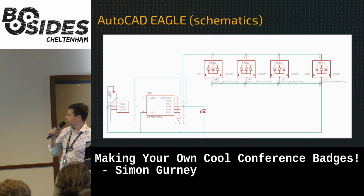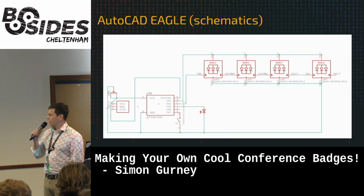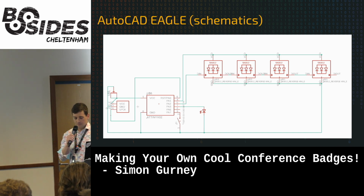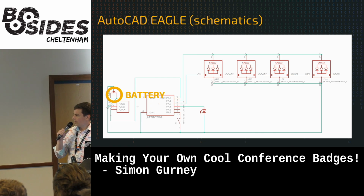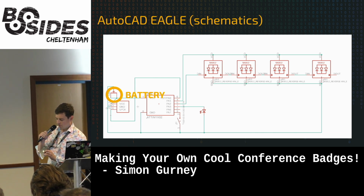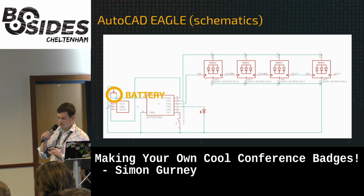So this scary looking thing is schematics. So electrical schematics, but actually it's not as bad as it looks. So I'm just going to walk through it now. This is the actual schematics for the DeLorean badges you've got on your necks. So over here we've got the battery. That is the battery cell with its 2 prongs left and right, which are your positive terminals, and then the ground plane, which you don't see, is underneath the battery.